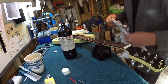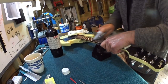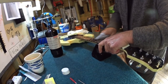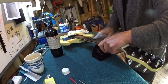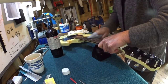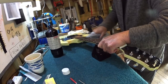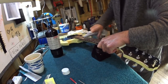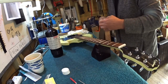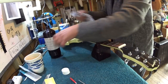And of course, once we've done all of this, then we have to polish out those frets in a hand polishing process using a variety of different grades. I won't show that on this video. It's a bit dreary, half an hour of aerobic exercise and noise, really. And all I need to tell you really is you do it by feel, and I use three grades of paper to begin with, which is 600, 1000 and 1500.